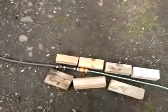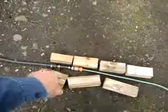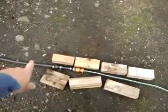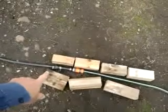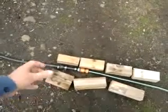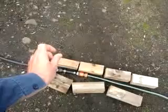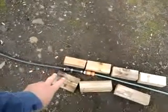But these need pressure to operate. I don't really have pressure. No, I don't have any pressure at all. But there's a way out of it. There's an old stunt they do with wood stoves, and those of you who own wood stoves will know about this. Connected to your hot water tank, or off your outline from your hot water box inside your wood stove, somewhere there anyway, you have basically a T-piece that then goes to a big upright pipe, and this pipe sits right up above the height of your house. That's designed for thermal expansion, not to cause too much pressure in the little copper box that's in your wood stove.